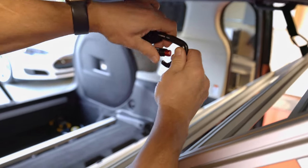We use a Jackery 1500Wh backup battery underneath the refrigerator to provide power to it, and it happened to perfectly fit under the fridge slider. I used Velcro strap to further secure the Jackery in place. The charging cable from the Jackery to the 110-volt plug of the van's AC inverter is neatly hidden in one of the channels of the 80-20 crossbar. The AC inverter allows us to charge the Jackery and run the refrigerator at the same time while driving. After four to five hours of driving, the Jackery is usually topped up to 100%, which is sufficient to keep our fridge at 36 degrees Fahrenheit for three days — so no need for solar panels.